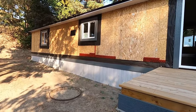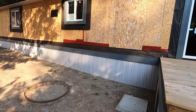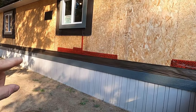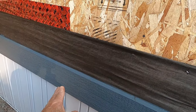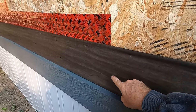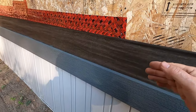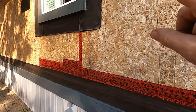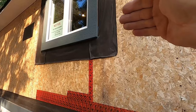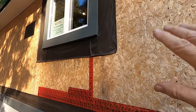I'm fitting my siding onto the up-against-finished product. So you can see how we've prepared along the way getting to this point. When we did this board, we put paper behind it so that if any water gets in there, it'll protect the wood. Next up, I'm going to be installing a flashing that comes over top of this, and then our house wrap will come down over top of that. Same on the windows — before we put our trim on, we put that tar paper. It all goes underneath the windows and overlaps like shingles to shed water.